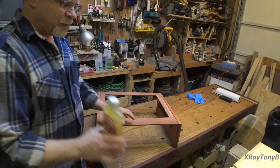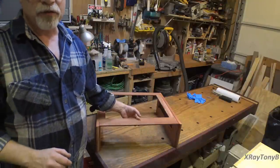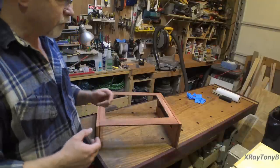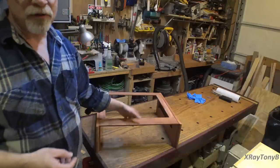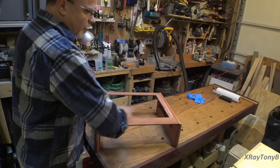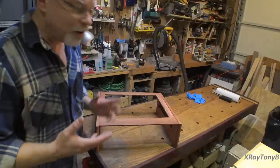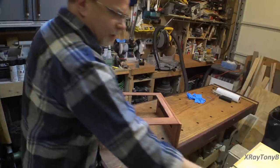And with this type of wood, Padauk wood actually has a lot of natural oils within it. One of the problems is getting stains or varnishes that are not oil-based to stick to it. It tends to mix with the natural oils in here. So you have to use mineral spirits and alcohol and things to try to clean the oil off. Even when you're gluing this, you need to wipe the glue off. I know I'm cutting my head off here. So this is a really good finish.